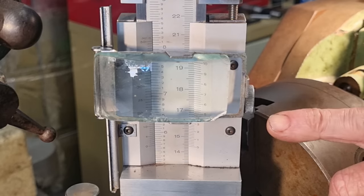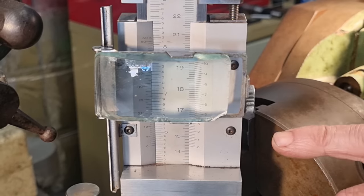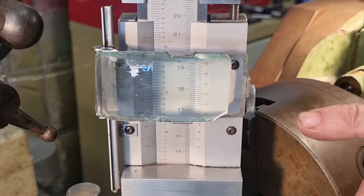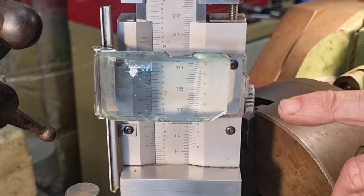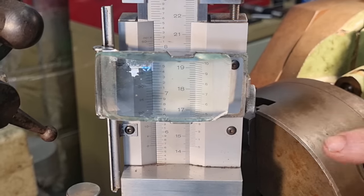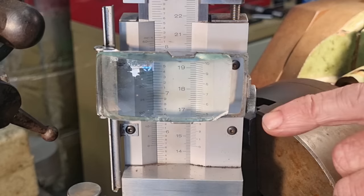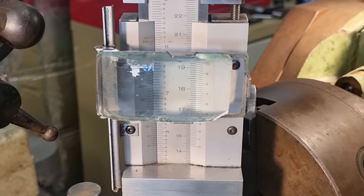So with our height gauge set on our amended height, remember we're going to add 0.127 millimetres, or 5 thou, it brings us our new height to the top of the cutter of 143.96 millimetres. So we have our vernier set, and we're just touching off now on the top of the cutter. Well, it's a vernier scale, but it's a height gauge.